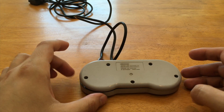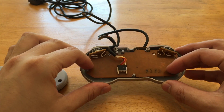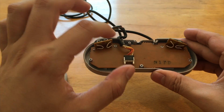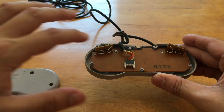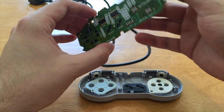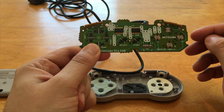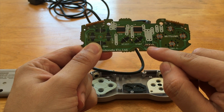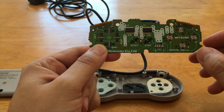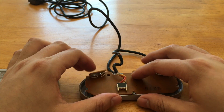The first thing I had to do was figure out how to fit all this stuff inside the controller, so the first step is really just mapping out your space. Inside the controller there's just a plain circuit board, so there's a lot of space to work with. However, this wiring harness is a little too high to give me clearance for placing the Raspberry Pi Zero. The good news is the harness connects to these front pins, which makes wiring the Pi to the button controls easier — you don't have to wire to each individual button, just wire to these five pins.